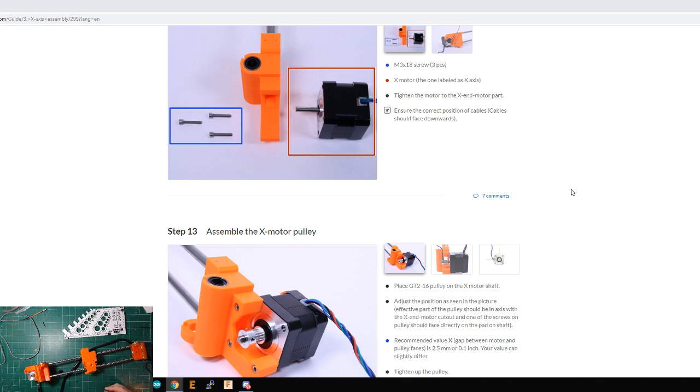So these are PETG parts. The old ones were ABS, and I guess I could have printed these, like the X-axis and the parts that don't get near the hot end, in PLA, but I do prefer PETG. PLA can crack and is a little bit more rigid. PETG is a little more flexible, or still sturdy, and has the same characteristics, I think, of ABS: definitely temperature tolerant and just as strong as ABS, but not as rigid as PLA.